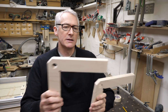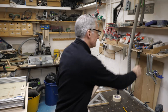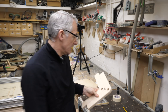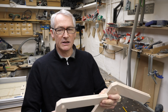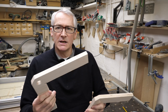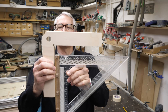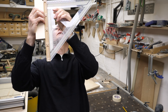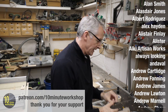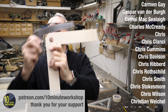The idea is, if you are building a carcass, one can go inside, one can go outside if you want, and you can get one of your clamps between them and you've got a flat end there to clamp against. I tend to just clamp against the sides — whatever you want to do with them. Just really simple. I hope they're square, actually. Check — absolutely 100% square. Not a squeeze of light between there at all, that's absolutely perfect. And on the outside, old Moore and Wright engineers square — absolutely spot on again.